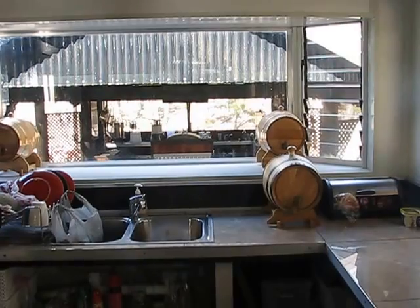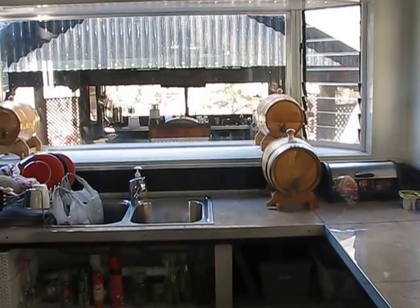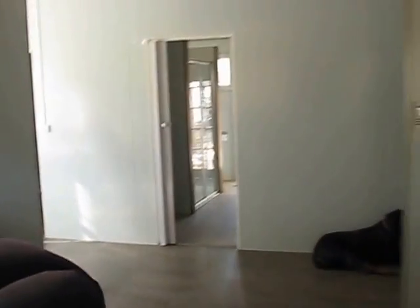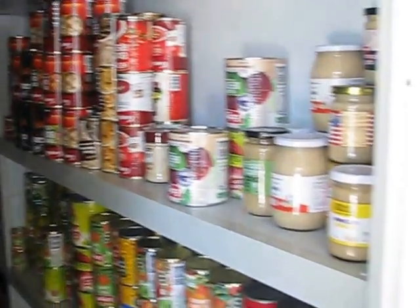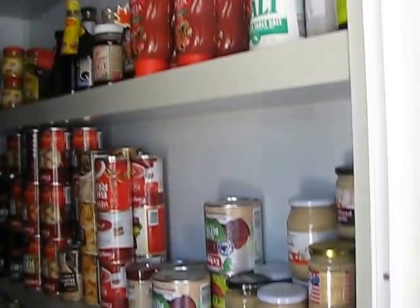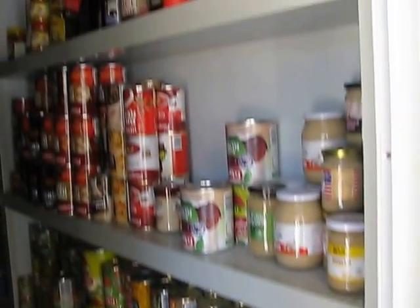It's usable for many applications. In the house, under the house, the roof, internal walls, cupboards. I'll show you the pantry. We even, as a shelving example, just before we go, there you go. Even the pantry, built out of SIPs. 50mm, C-channel on the front edge. Very easy, you pop rivet to the wall, no nails, no glue. Just like Meccano kits, alright? So, there you go. You can even build lots of your internal stuff with it very cheaply.